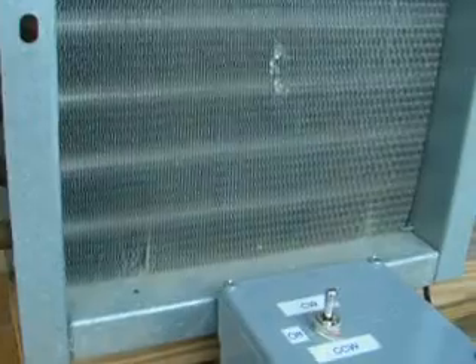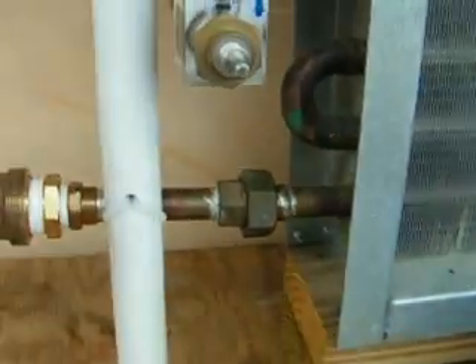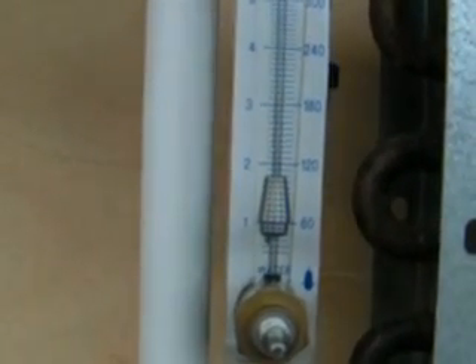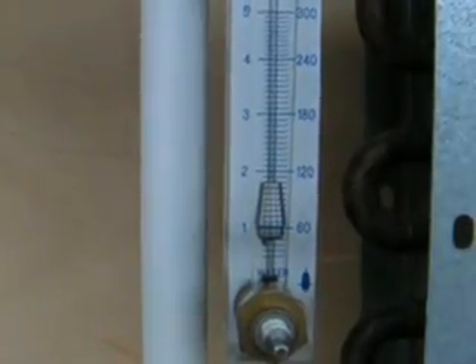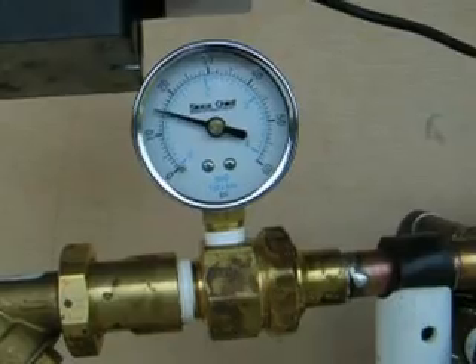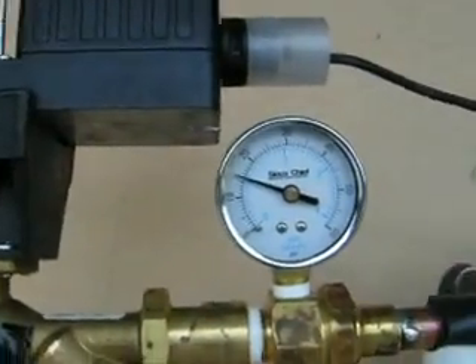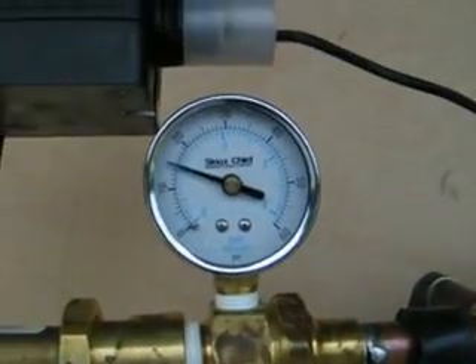What I'm going to do is simulate opening the thermostat with the switch box and see how it responds. The temperature control is simulating a room condition where it's not full open — it's partially open. I'm going to use this pressure regulator right here and simulate some pressure increases in the building. We'll watch it on the differential pressure gauge. We have our temperature control valve partially open, about 1 GPM and 15 pounds differential.